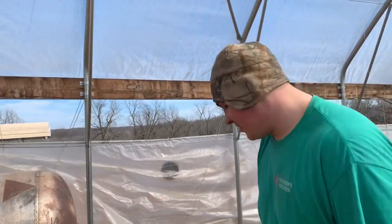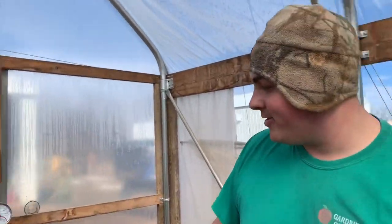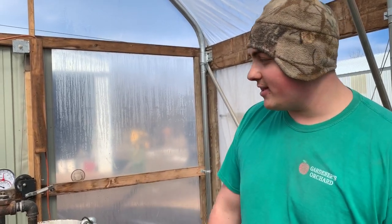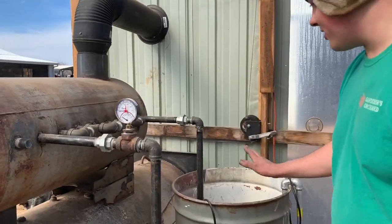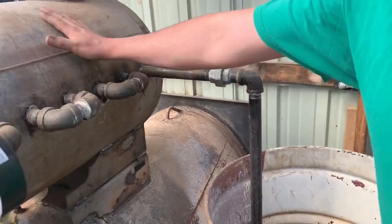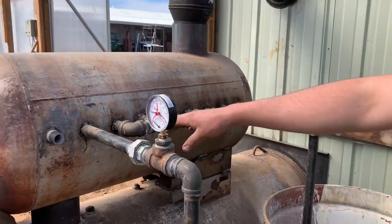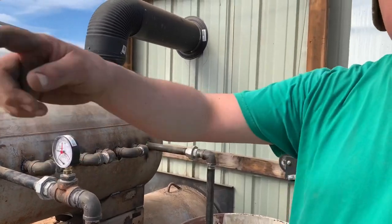So we're like, wait a minute. Me and my brother Val, we came up with a little invention here. What we do to heat up the soil, instead of buying a different contraption with propane heat, we were like, well, you know what, let's just kill two birds with one stone. So we got a sump pump here, the pipe is running through, we drilled holes through the top tank here, and the smoke heats up these black propane pipes, and then it pumps into the ground, it circulates around, comes back around, and then it heats up our soil.